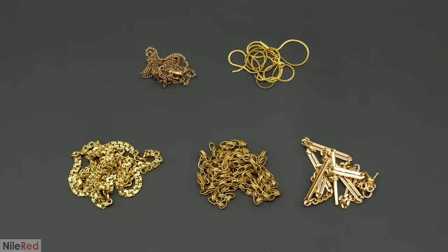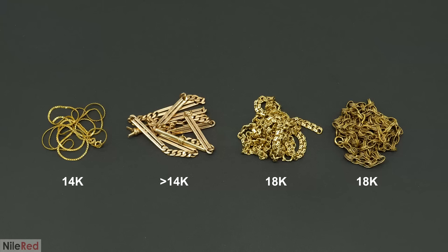I now had an idea of how much gold was in each chain, and I knew that this one probably didn't have any gold at all. I decided that I would still process it though, but I would do it with all that other scrap stuff. To process the chains which actually had gold in them, the next step was something called inquartation. This just meant that I had to mix it with another metal, like copper or silver, to knock down the gold concentration. Typically, the target is around 6 karats, so about 25%. By doing this, the gold stops being able to block the other metals from nitric acid.